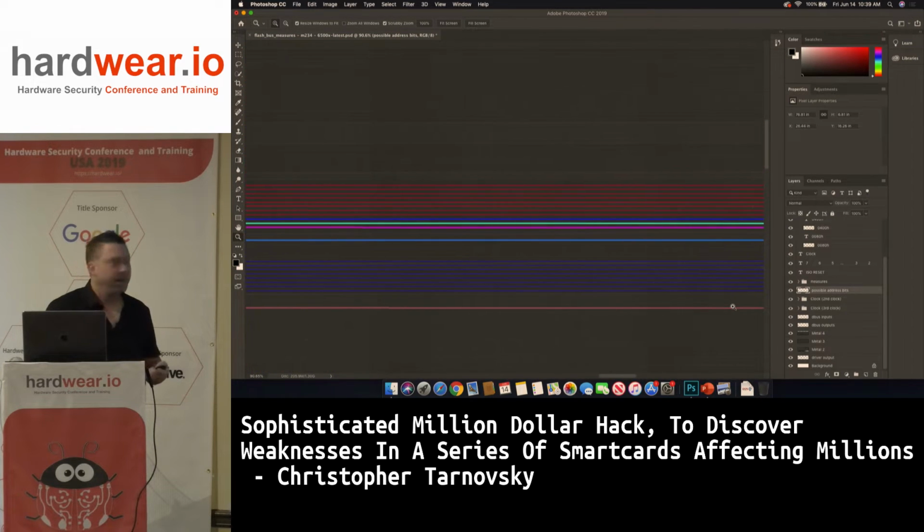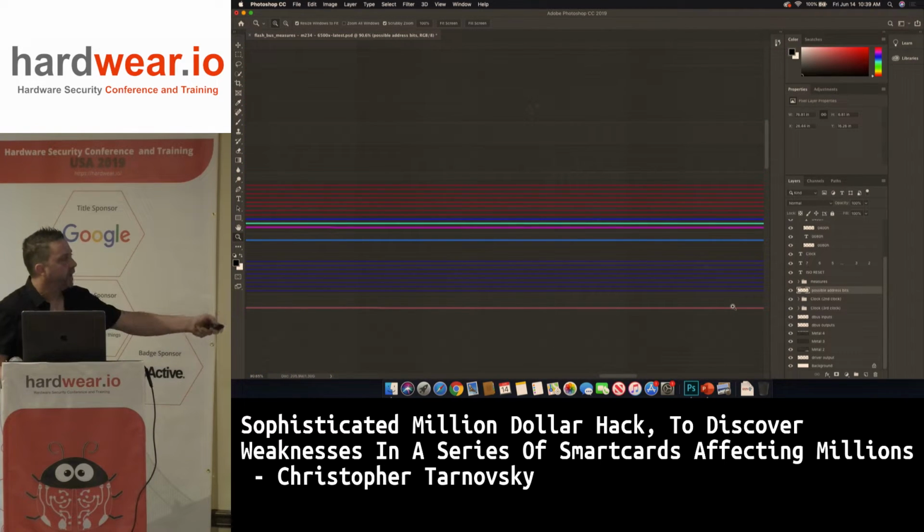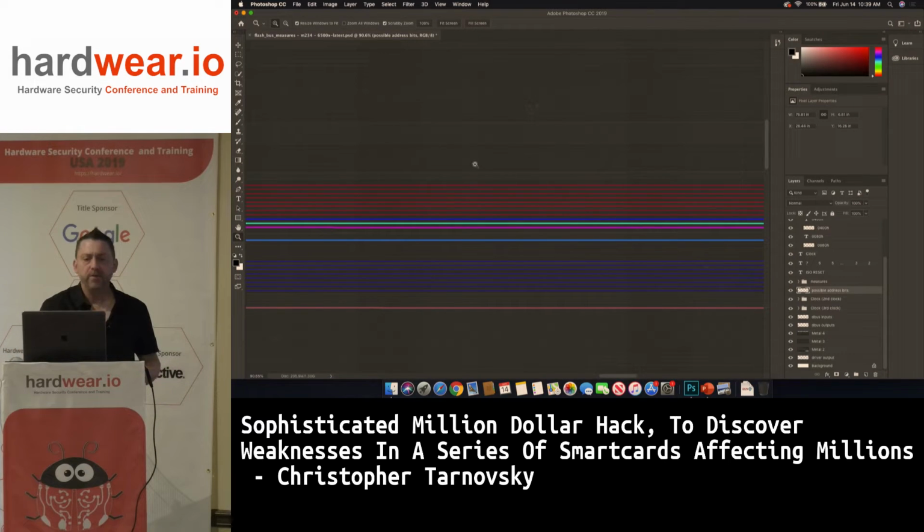And so as I said again, the flash bus got cut over here somewhere. I don't remember if it's this or this, but one of these was the 8-bit output of the flash. So you strap the boot ROM, you cut the flash, and it's game over on every EM Micro chip they've ever made.